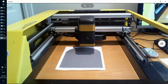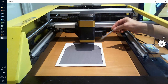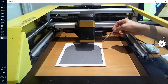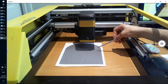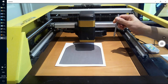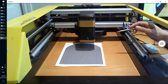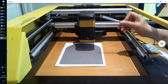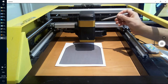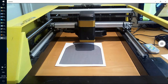This is, by the way, the new version of our etching machine, which does not even have the gap sensor. In the previous version, we had a lever that was always sliding on top of the stone, thus giving us the reading of where the stone is. In this machine, the etching head and the diamond tip itself act both as actuator, that means as the tool to hit the stone, as well as the sensor to actually tell us where the stone is. If you were to remove the lid of this etching head, which I totally don't advise you to do, but if you were to look inside, you would see that there's a motor that constantly moves the head up and down, okay?